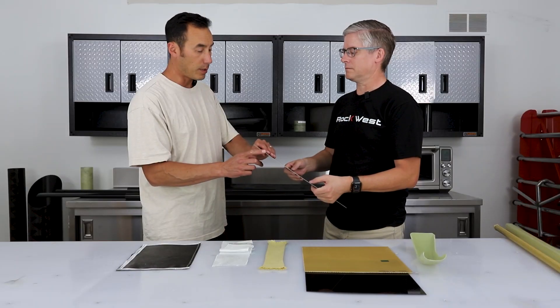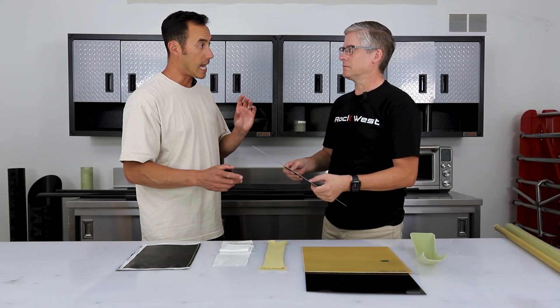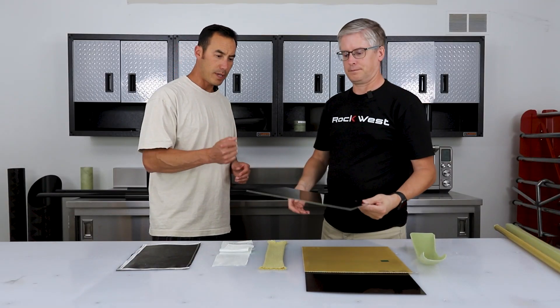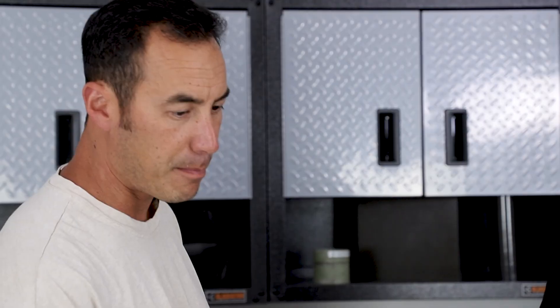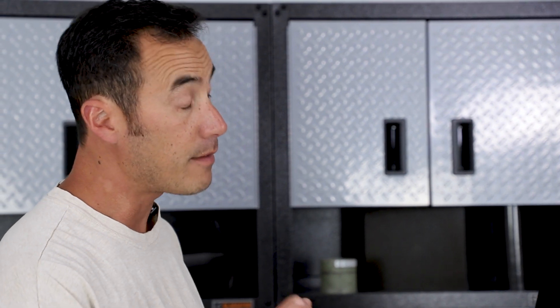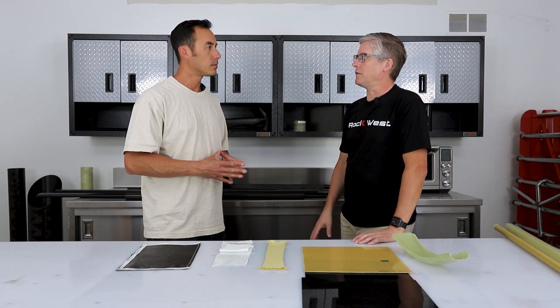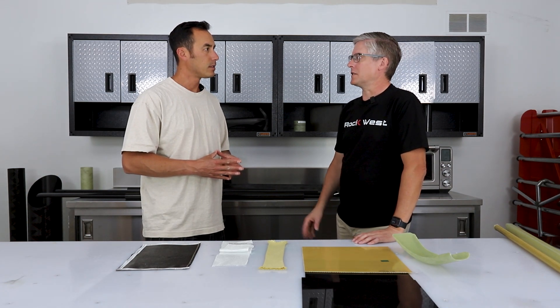Without the Kevlar, if we replaced it with carbon fiber, would it be as stiff or stiffer? It should be stiffer — a panel with the same number of plies in all carbon fiber would be stiffer. As for the difference between a pure carbon and fiberglass panel, fiberglass is automatically a little bit more flexible. It doesn't have the same stiffness modulus that carbon fiber does, so it automatically is more flexible.